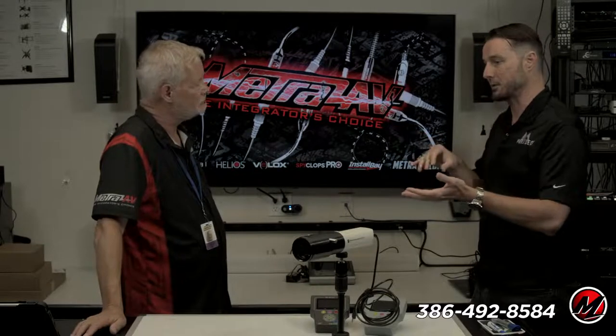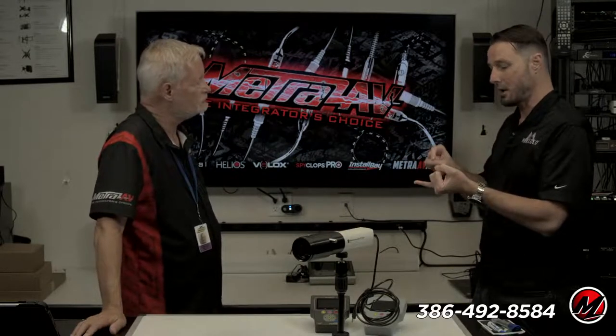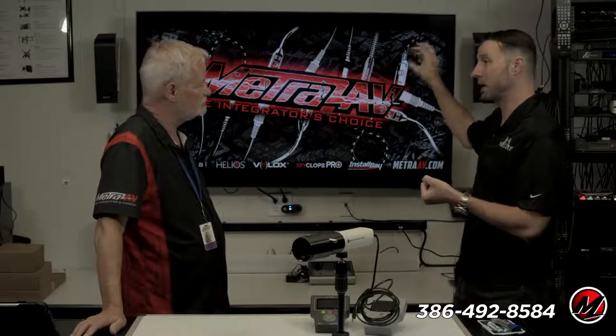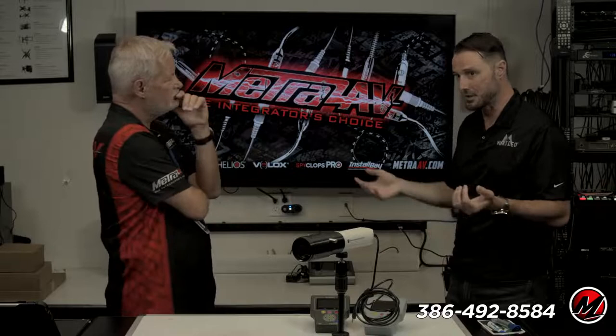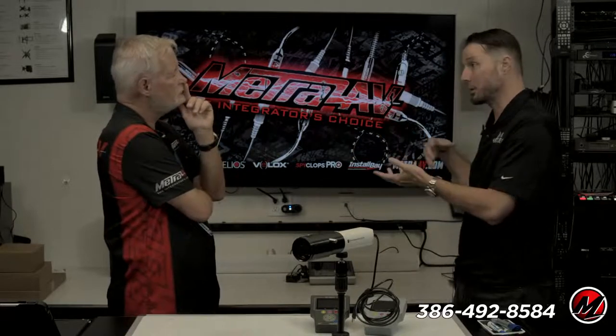So if you take a technology like HDR10 Plus or Dolby Vision, you mentioned before dynamic metadata, there's information along with the signal that says, okay, at this timestamp, I want these pixels to be this bright and this color for this many frames. And what's cool about that from an artistic or content creation standpoint, if I'm color grading a movie and I'm sitting there with the DP and the cinematographers, we can say, okay, let's make this scene really, really, really dark, except for this one neon light. And it just absolutely pops out at you. Well, guess what? That's how we see stuff in real life.